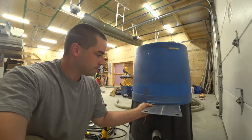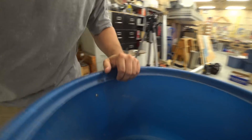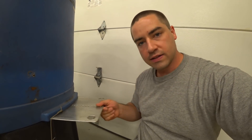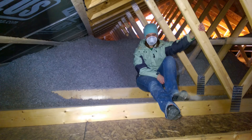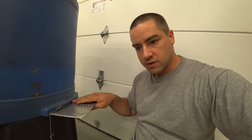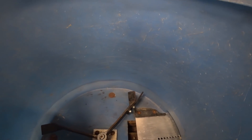Put it in the slot, and as you push this in, it's going to close off that opening and restrict the amount of insulation that can fall down. There might be situations when you want to open this feed gate all the way instead of closing it. That would usually be just in an open blow. But with this particular machine, you really want to be careful with ever opening it all the way. You're probably going to want to keep this closed down. If you're dense packing, you're going to want this closed down quite a long ways — maybe something like a relatively small opening.